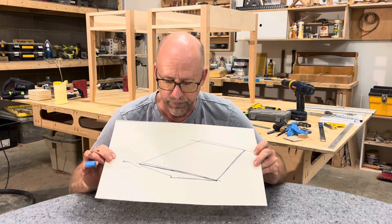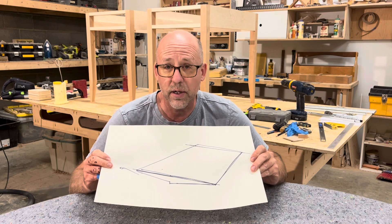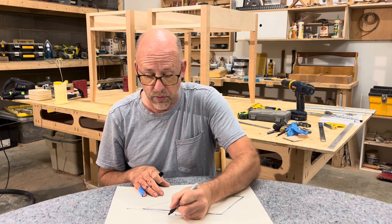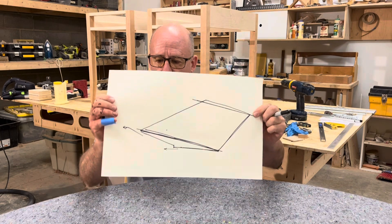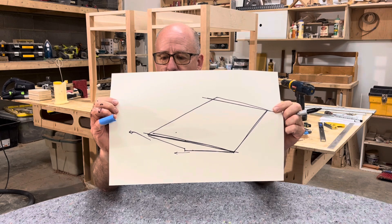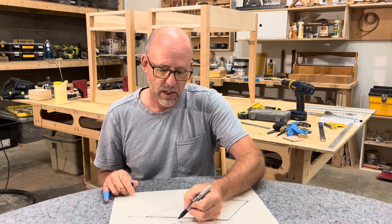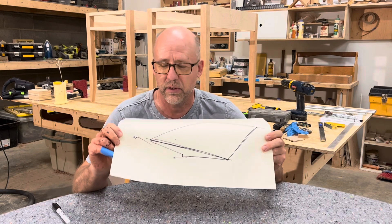What I tried today is basically a double wedge with a step in the middle. The drag went way down, but it didn't ventilate - I could not get the flow to ventilate that surface. A transom that goes upward will lift water, and that's what was happening. The harder I paddled, the floats actually started going down instead of up.